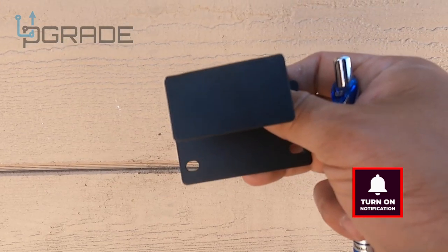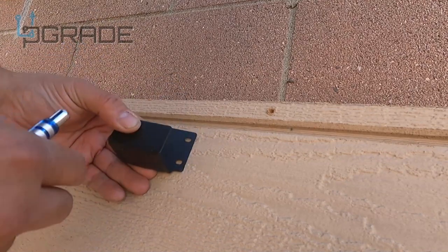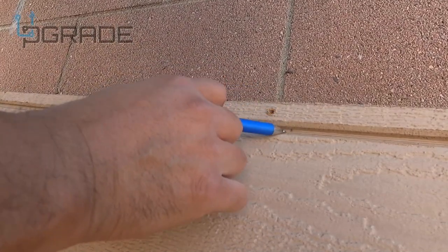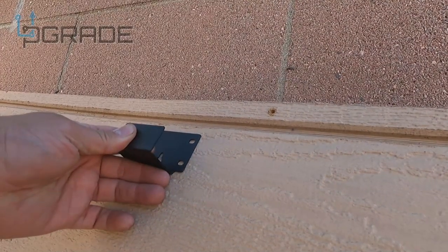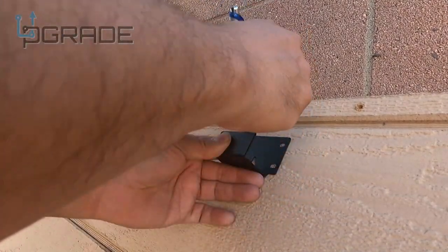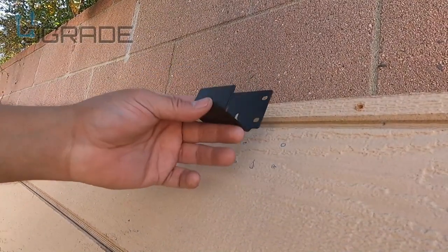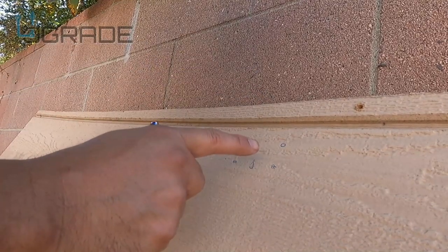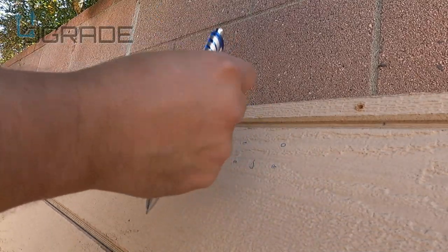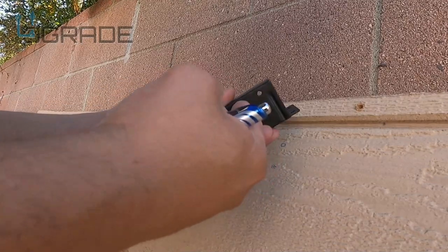For the pre-install demo I'm using a piece of wood to show you exactly what needs to be done. I'm putting my camera down so you can see better — facing it up so the two screw holes are visible. We line it up how you want, level it, mark your circles, mark your holes. Pre-drilling is essential — if you don't, you'll crack the wood. If you're mounting on drywall, use drywall screws.